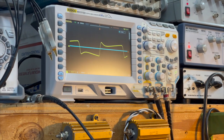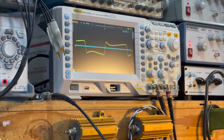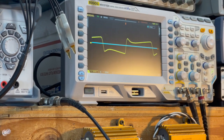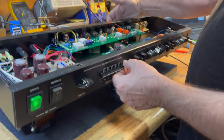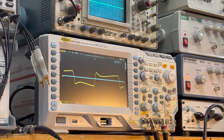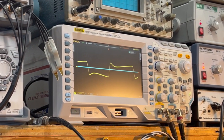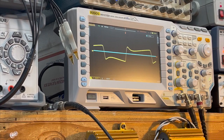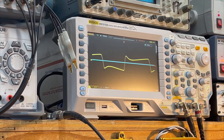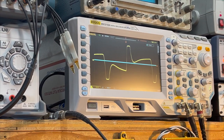And then we go and we add the graphic EQ right here. Now, the EQ is set flat, so you don't see anything happening to the square wave, except a barely perceptible little level difference. Then we have, what happens if you jack up the high end? Probably those little peaks. Well, here's the high end. Yeah, that's what I thought.